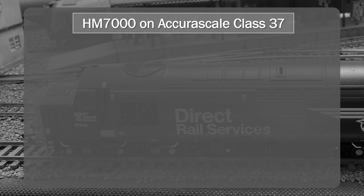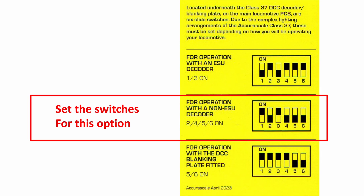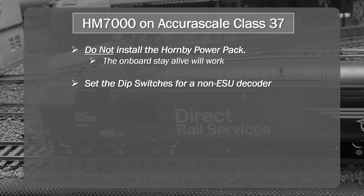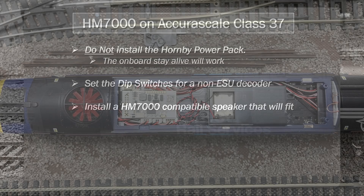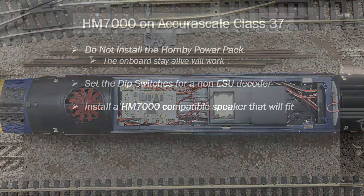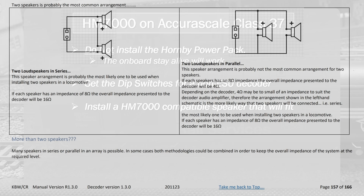Let's look at how you configure the locomotive with the HM7000 decoder. There's no need to install the Hornby power pack — the onboard stay-alive capability will work fine. You'll see this when you take it off the track: it retains power for around 10 seconds or so, so you should not install the Hornby power pack. You need to set the dip switches on the locomotive for a non-ESU decoder, since this cannot access the extra functions that an ESU decoder can access. You need to install a HM7000-compatible speaker that will fit in the cavity. I was able to fit the larger speaker compartment with the out-of-the-box sugar cube, and also used a separate bass-enhanced speaker of a relatively small form factor. If you want to use larger speakers, you're going to be relatively restricted for space, and you are limited to 8-ohm speakers in general.